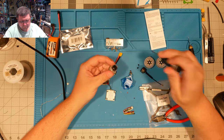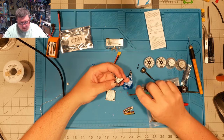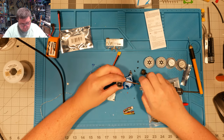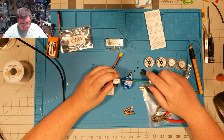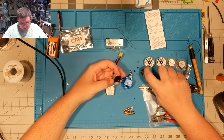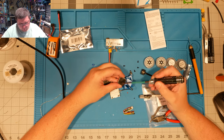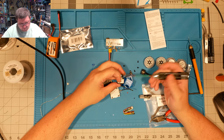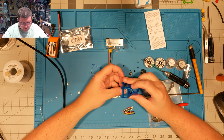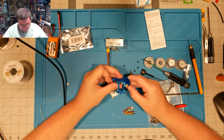That's all right. And double check your orientation. So on these Vistas in particular, anyway, quality control stickers on top, and that's a good way to orient yourself. On the full size air units, it's usually on the bottom, and there's a very faint arrow in the plastic here. I'm not sure you can see it. There's an arrow pointed up this way, meaning this is the top. So it doesn't really matter which way you put it in, because you can change it in the goggles, but you can avoid a step and get it right the first time. Might as well.